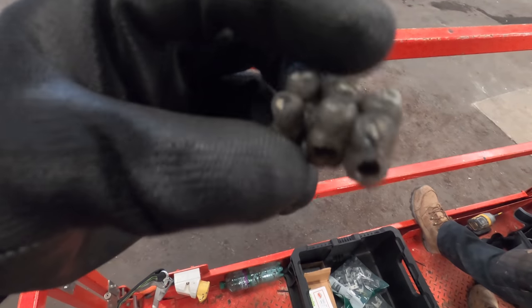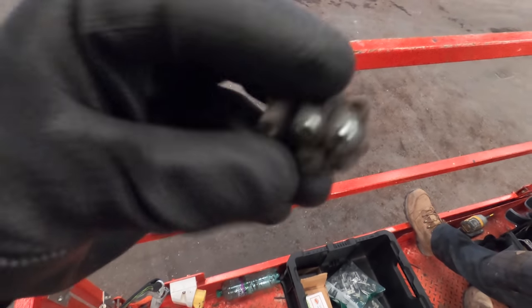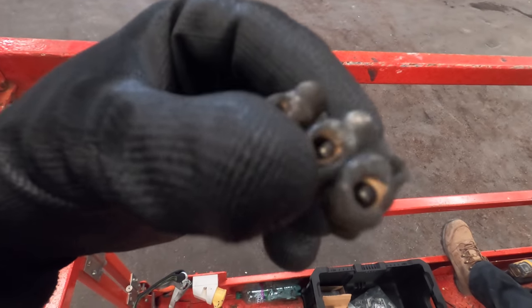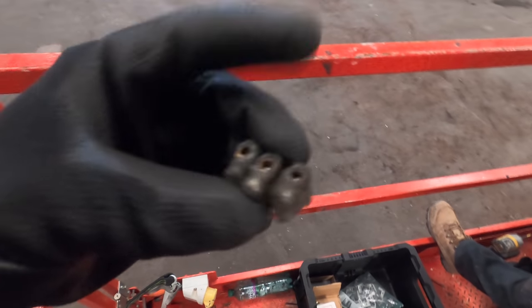So this is the state we're finding some of these connectors in. I don't really know why, because they are LED, but we'll have to look at what they're pulling. There's been three or four like this — just melted connectors. I don't know if it's the lights themselves getting hot, but we're just swapping them out for lever connectors anyway and then putting boxes around them.